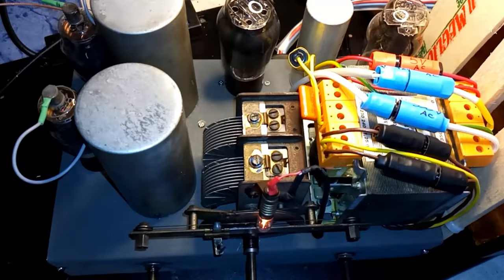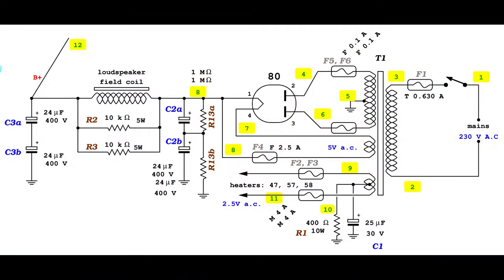Before trying the radio, some fuses are added to protect various parts of it. In practice, beside a main input fuse, all transformer outputs are protected by a specific fuse. Nowadays, nobody would want to take the chance to damage fairly rare antique vacuum tubes.